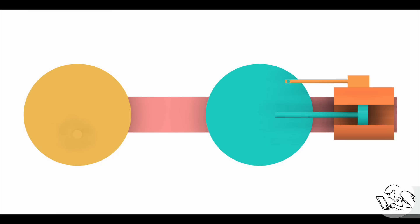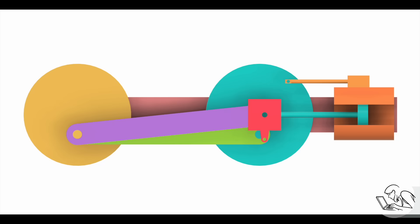Let's figure out what all those little linkages that you see are actually doing. Here is the basic geometry of a steam locomotive. We've got our four drivers, and we've got a piston and a valve. The drivers are connected by side rods to transmit power between them, and the piston is connected to the rear driver with a main rod and a crosshead. That translates the linear reciprocating motion of the piston into the rotational motion needed by the drive wheels. So this is, in effect, the crankshaft arrangement of a steam locomotive. However, this isn't an engine yet because the valve can't move in time. The job of the valve gear is to slide that valve back and forth such that it's connecting the steam coming in from the boiler to each side of the piston at just the right moment to push the piston back the other way. Steam engines are double-acting, unlike internal combustion, so we need to be shuttling steam from one end to the other rather than just opening and closing at a particular moment. Every stroke in a steam engine is a power stroke.